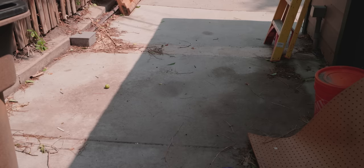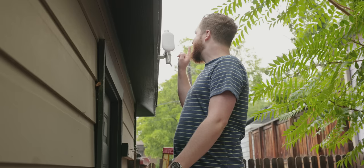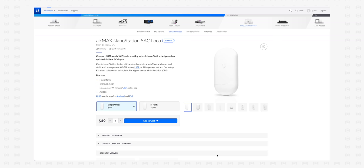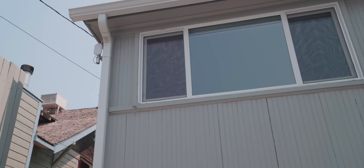The easiest, most robust solution is to just dig up some of your lawn, put some conduit in the ground, and run some Ethernet cable through there. But I don't have a lawn — I've got a cement driveway, and I'm not about to go dig up part of it. So my last option was a point-to-point bridge. I was a little hesitant, but it works really, really well. This one's made by Ubiquiti. I bought them for like $50 to $80 — they're really cheap. Basically, it's a wireless Ethernet cable. I have one on my house and one here.